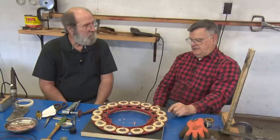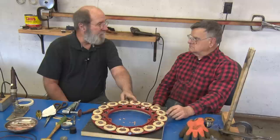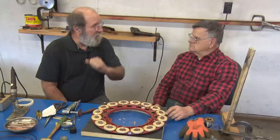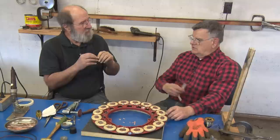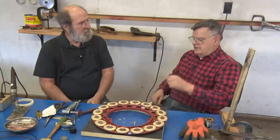Okay. And some that I've seen pulled out of engines, something ripped, a magnet or something really impacted that coil. It's just like taking a chisel almost and hitting it. They aren't broken, but they're just really crimped up. Are those ones that you use the technique to straighten up some of the little bumps? You can unroll it and look at the damage. If it's consistent damage every turn and it's not torn, yeah, fix it. It can be straightened. But if it's torn, it's not worth doing.